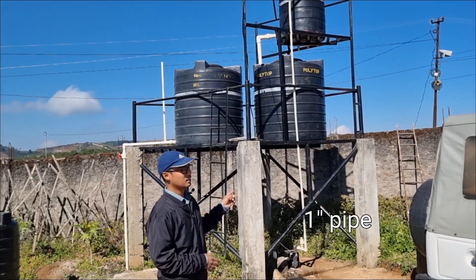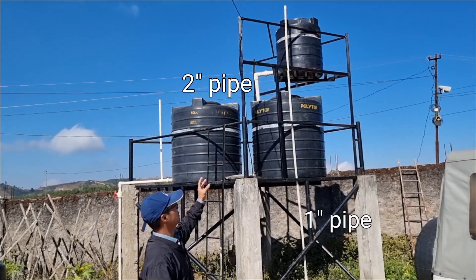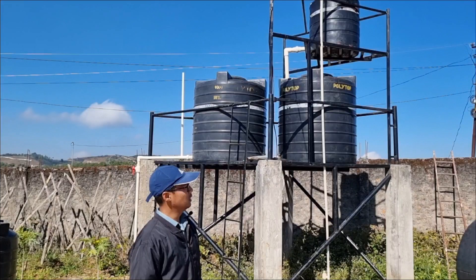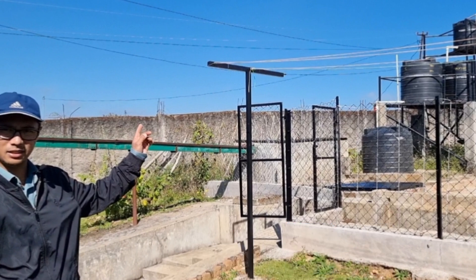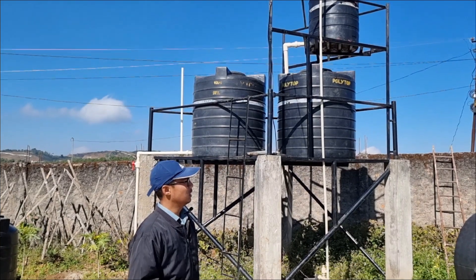For pumping I use a one-inch pipe, and for the outlet a two-inch pipe, so the system doesn't get clogged or overflow from the top. Another advantage is that the gutter is inclined towards the top of the hill slope, which means the storage cistern is located at more or less the same level as the house. This means the pumping head is not much, so I only need a very small half-horsepower pump.